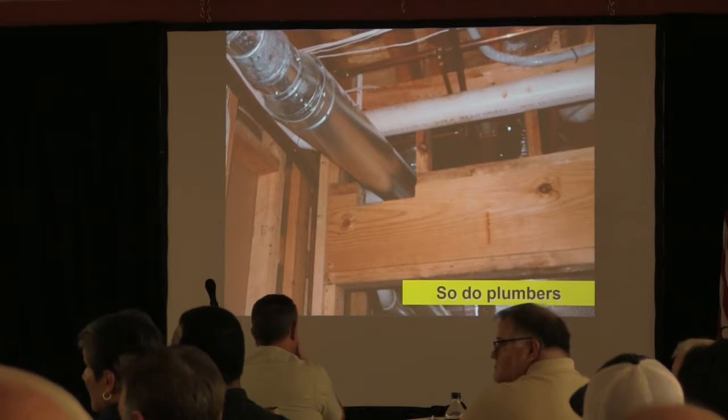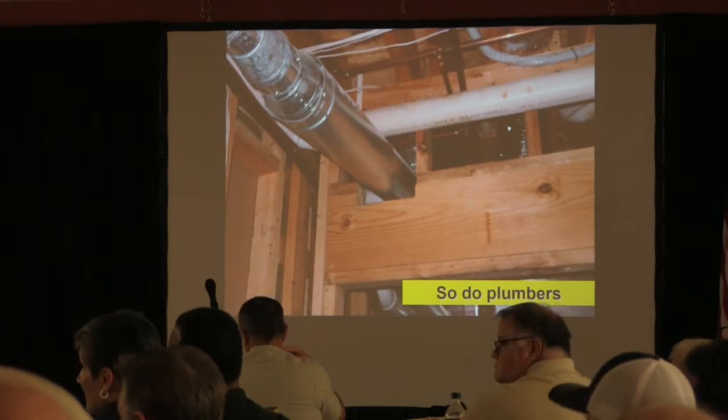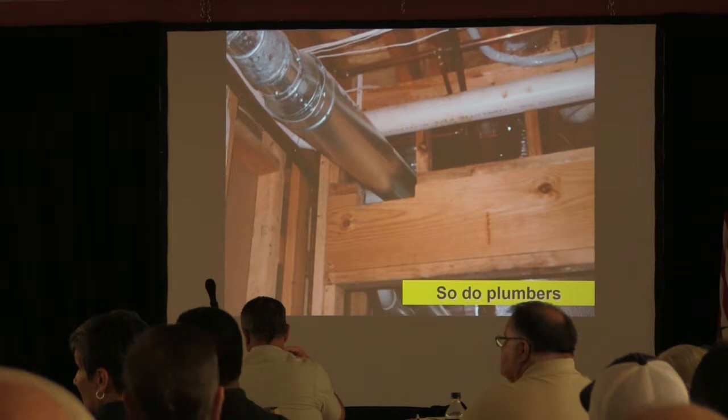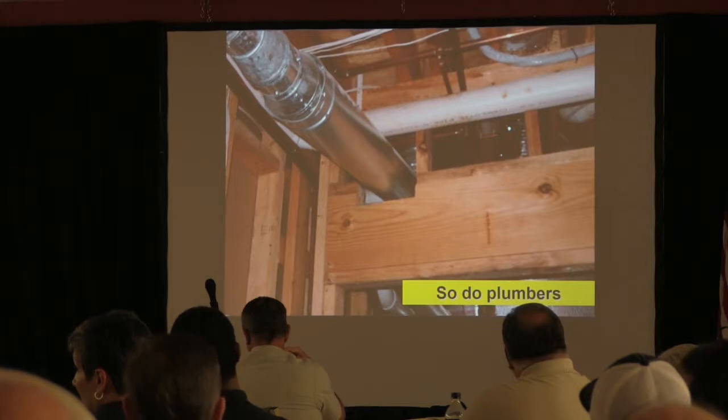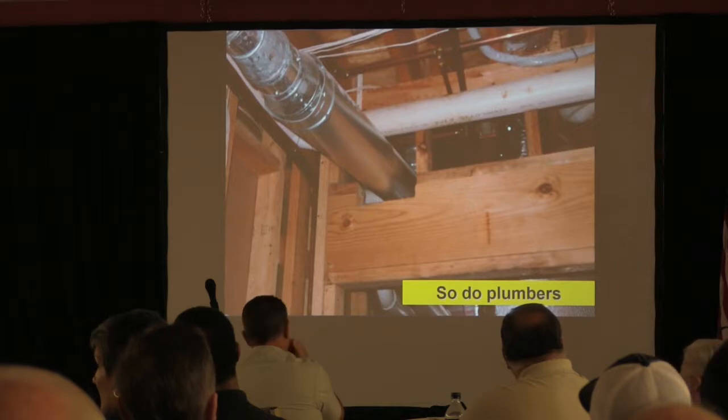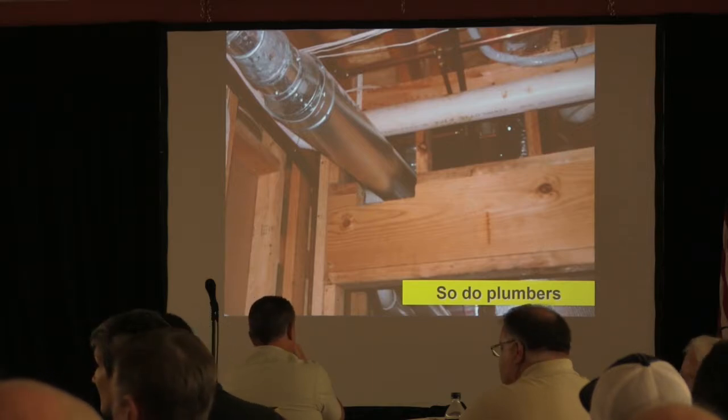Okay, in reference to my homework assignment. Yes, sir. It seems to me, from what I was able to look up, that if you see a condition where the stud is that much overcut, and it clearly violates the notching and hole standards, you should really ask them for the structural data on that stud shoe, and what is it rated to hold? Can it take the load that the stud would ordinarily take? Right. That's really the only answer you can give. Yeah, and that's what you did.